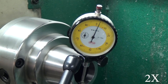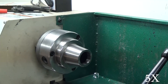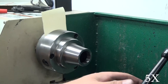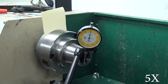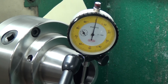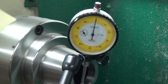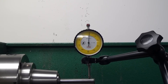You can see here I've got about three thou of total run out. With the indicator I marked where the high spot was, and then using a sticky note I shimmed between the chuck and the backing plate, and it totally worked — it got it down to under a half thou run out, which is just amazing. The run out has come back, and I haven't really bothered to check why, because it's still running out less than my three-jaw chuck does. I need to do something more permanent than a sticky note — I'll probably get some brass shim stock. I imagine the paper has collapsed or has taken on some humidity.